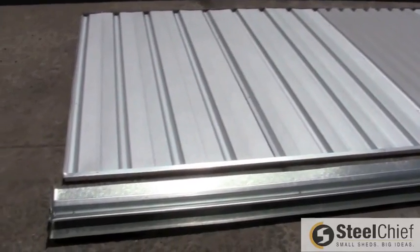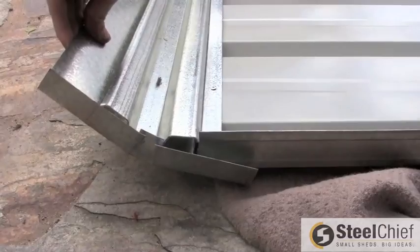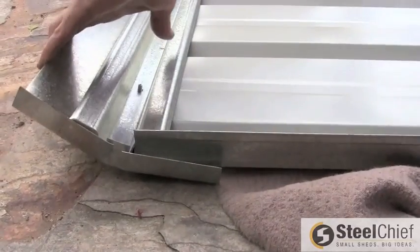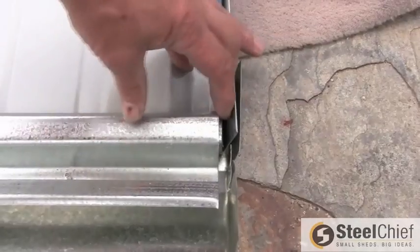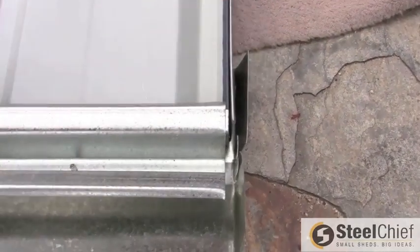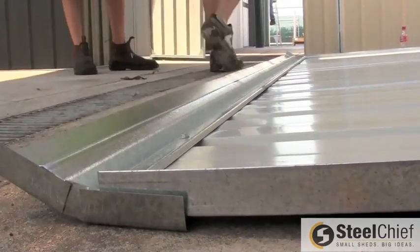Place the ridge beam and roof panel on the ground and upside down. Fit the ridge beam to one of the roofs, pushing them together until the side channel of the roof is firmly wedged between the cap and beam of the ridge. Ridge beam overhang should be equal at both ends. Screw at either end and then one screw per sheet.